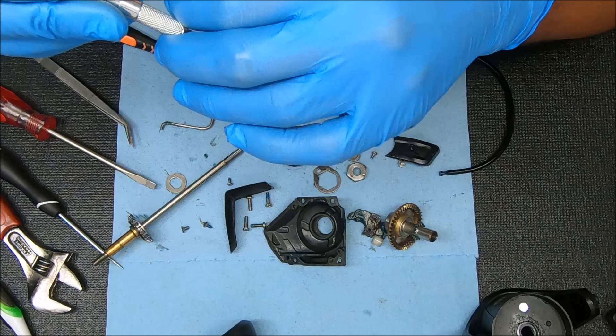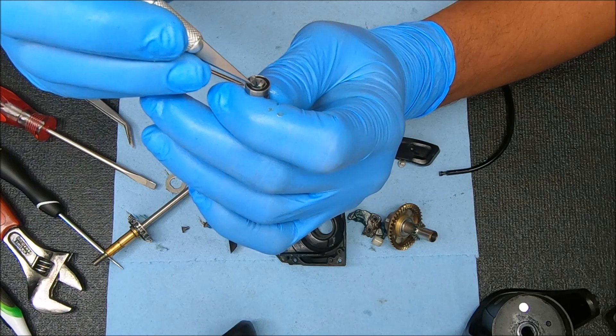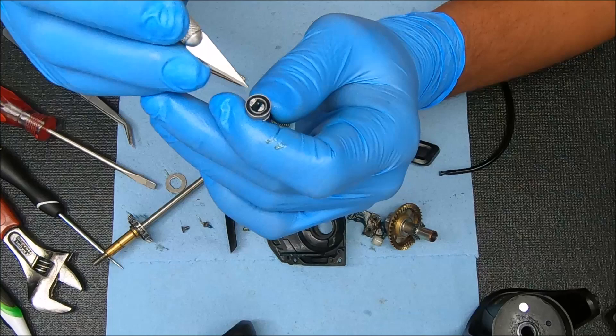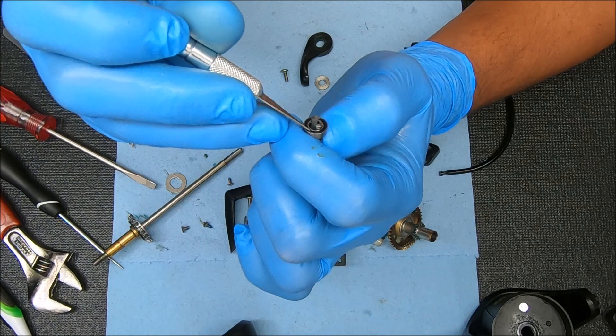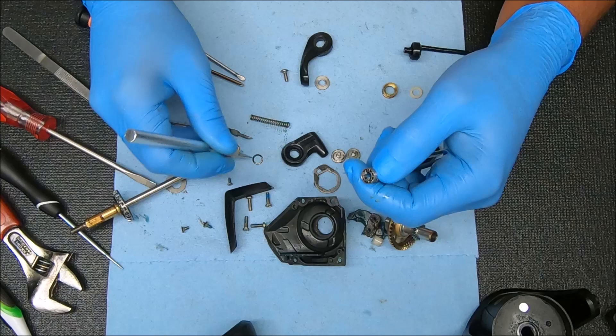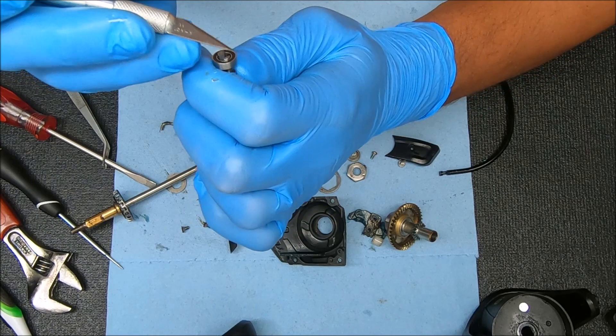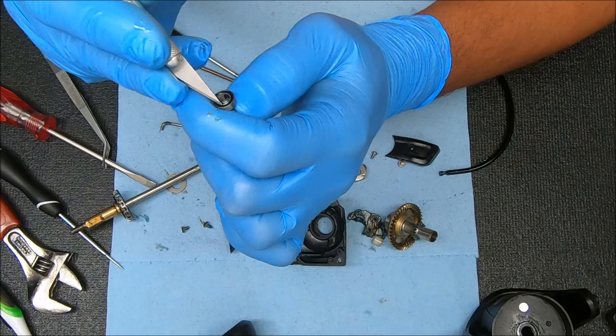Notice this is a sealed bearing, but these you can pop off just like any other bearing — there's a little different procedure in doing it. I'm going to stick this exacto knife gently inside there, then it just lifts up and comes off. I'm not going to put it back on. For the rest of the steps and refurbishing bearings, you can check my video library for how I do that. The bearings are a little bit different but the procedure is still kind of the same. For other bearings with similar issues I'll do the same thing.